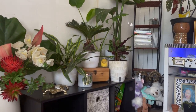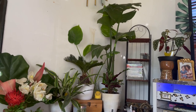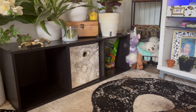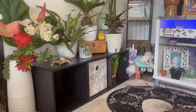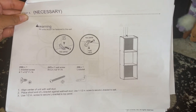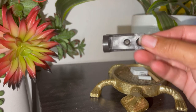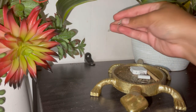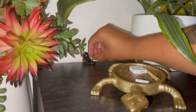Reason number two: even if I had this standing vertically and it tipped over, it would rip out my entire wall panel since I don't have wall studs. I don't have the time or money for that. However, if you have small children I do recommend doing this step. If you choose to do it, align the center of the unit with the wall stud, place the short end of the L bracket against the wall, use a one and a half inch screw to secure the L bracket to the wall, then use a half inch screw to secure it to the top panel.